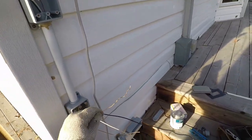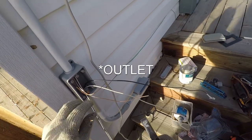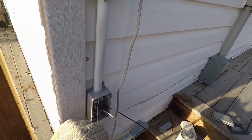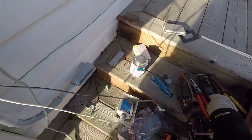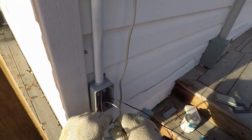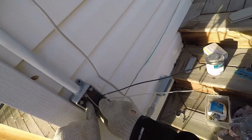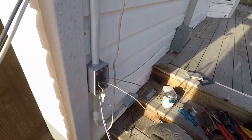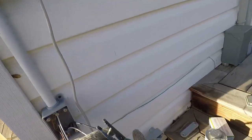so we'll take this guy because we need the ground for the plug, and then we need ground carry through up to the other plug. So we'll just splice these together, toss a wire nut on them. This guy can go back up there, we'll fold these in, and that'll go to our GFI. It's just a matter of prepping everything and putting the plug on.